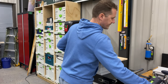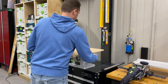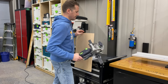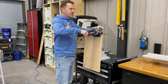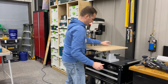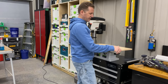It's way nice to be able to — just forget about clamping and all that — because you can loosen it up, spin it, do whatever edge you want. You can loosen it the other way and spin it this way. A lot of times when I'm building cabinets I've got to put dominoes in from the side and then the face too, so you can just switch back and forth. It's a huge time saver besides being really cool. You hit the foot pedal and it pulls right off — otherwise it's stuck.